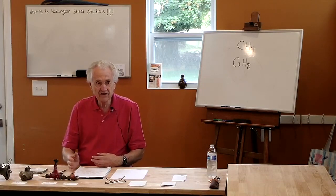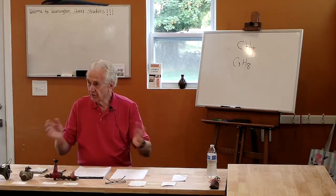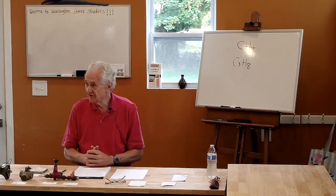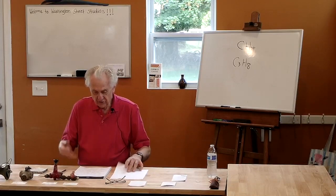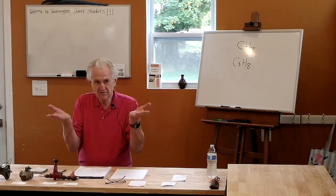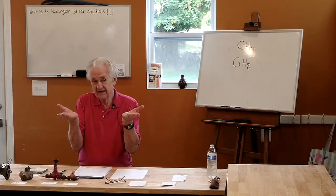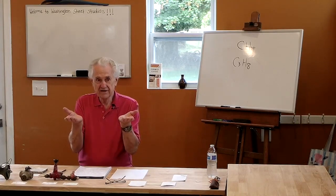Natural gas is lighter than air, so if you get a leak, it tends to rise and disperse, but propane doesn't. This is also why it's a hazard in houses. This is why they don't normally put it in as a normal rule, because if you had a basement and you had a propane leak, you'd fill up your basement like a swimming pool full of propane gas. And it would either explode or you'd walk down into it and suffocate.